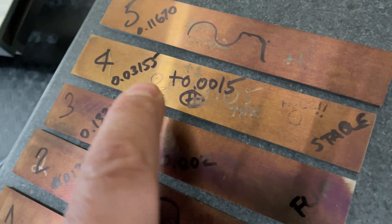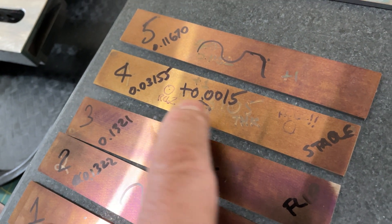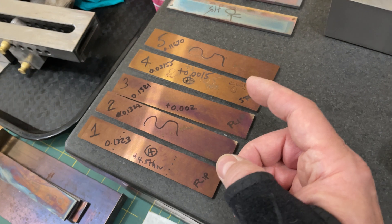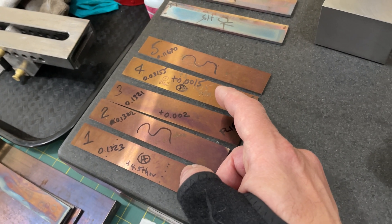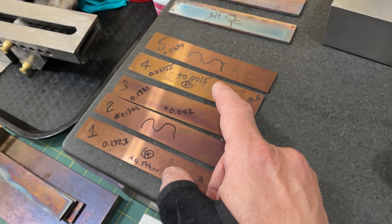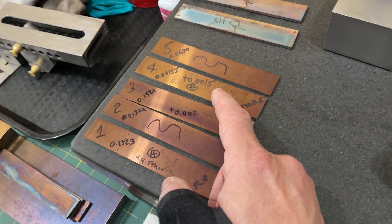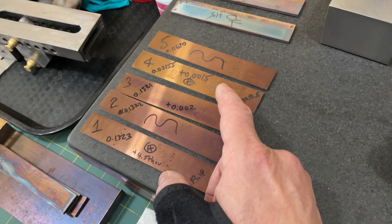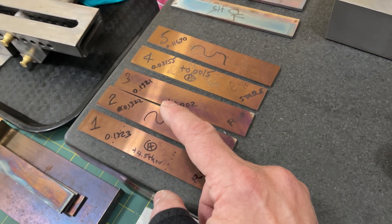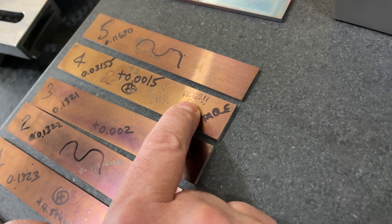The hardness increased and we got a genuine reading of Rockwell 62 on sample number four. Part of why the sample might be reading higher is that performing a hardness test on a properly surface-ground parallel part is the correct way to do it. Doing it on a non-surface-ground part can lead to lower than accurate readings, so we're not sure where it came from but we're getting some pretty good hardness.